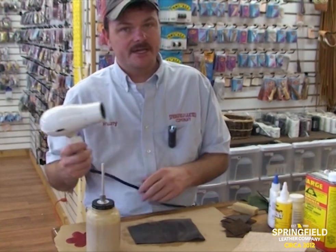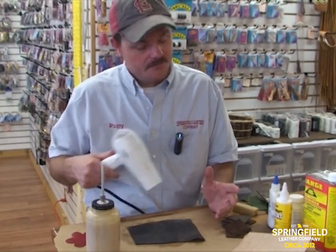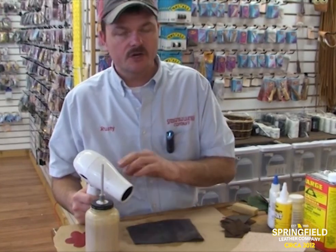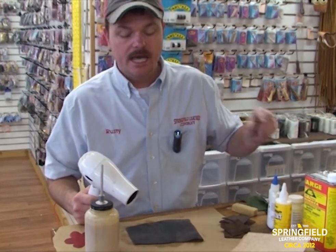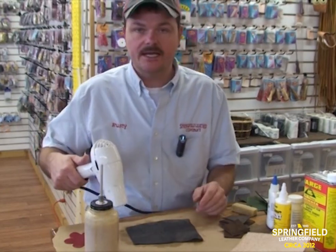Now, I'm not a very patient person, as you may know. So what I like to do is cheat. I like to take a hair dryer to speed this process up. The first coat, if you're going to do a two-coat process, can be absolutely dry, it can be days old. It does not matter how old it is, as long as it's clean. So I'm going to dry this real quick, and then we'll apply a second coat.